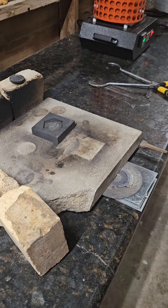I just don't know, guys. I might have to change my ambient temperature in here — maybe that's the problem. It is rather cool outside. It seems like the crucible is not the problem; when it comes out, it almost instantly solidifies. So we'll see what it does. Preheating for attempt number six — still kind of sort of warm, but just got to be careful not to crack the mold. Better to get it nice and hot than not hot enough and crack it.